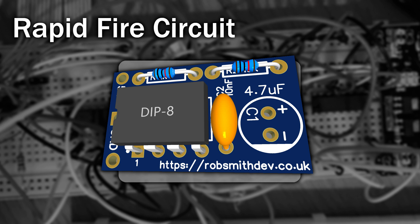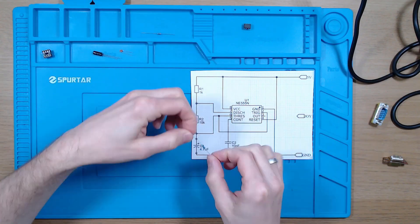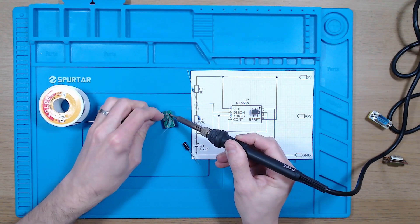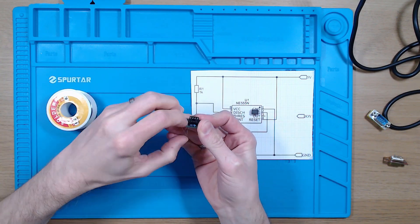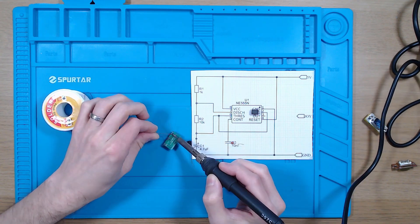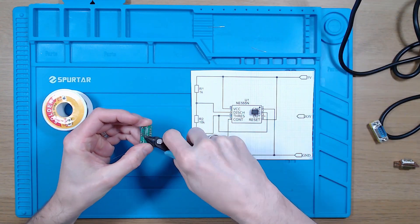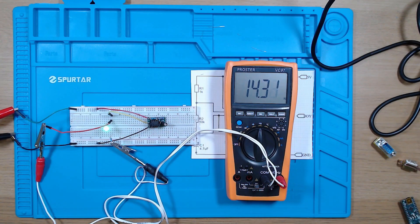But I don't want a load of random components floating around, so it would be better to build a PCB for these to be soldered onto. There are several places to order PCBs from and for such little cost. After waiting about a week these turned up from JLC PCB. I've left a link in the description so you can order your own. I'll now assemble one of these. I'm going to play this a little bit faster as no one wants to watch this, but first I set about placing all the components where they would be on the circuit diagram. Then I slowly insert each one into the board and solder them in turn. I'm using a chip holder here just to make things a little bit easier, but the 555 is pretty robust so if you haven't got one it doesn't matter. The last part I solder in is an electrolytic capacitor. It's very important that you get this component installed the correct way around.